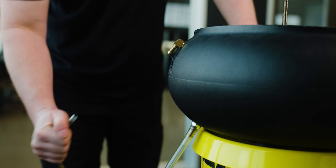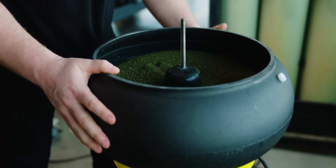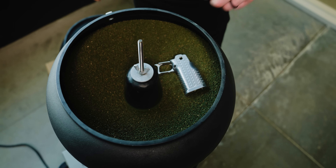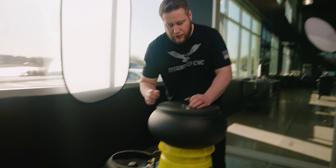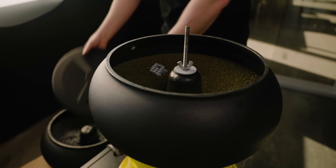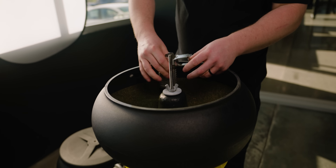I actually made a couple of show pieces just to have around the shop, so I'm going to clean one off and change our media out to walnut shell. Typically you wouldn't do walnut shell because there's no sense shining it up when it's just going to get bead blasted and then hard anodized — but we're doing that just for the show pieces to make them nice and beautiful. So after a couple more hours, that is it complete. It's got a little film from the walnut shell so we're going to get them washed off and sent out to James so he can get it built out. Make sure you check out the Titans Alpha 1 at ParadigmArms.com.